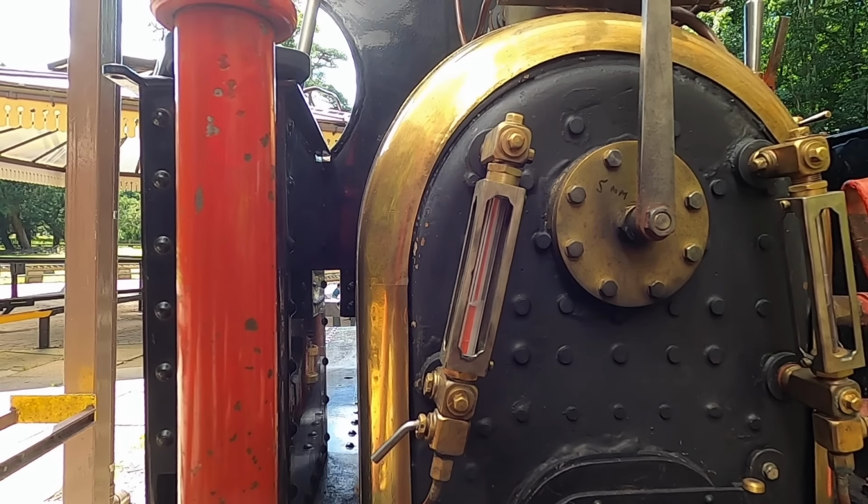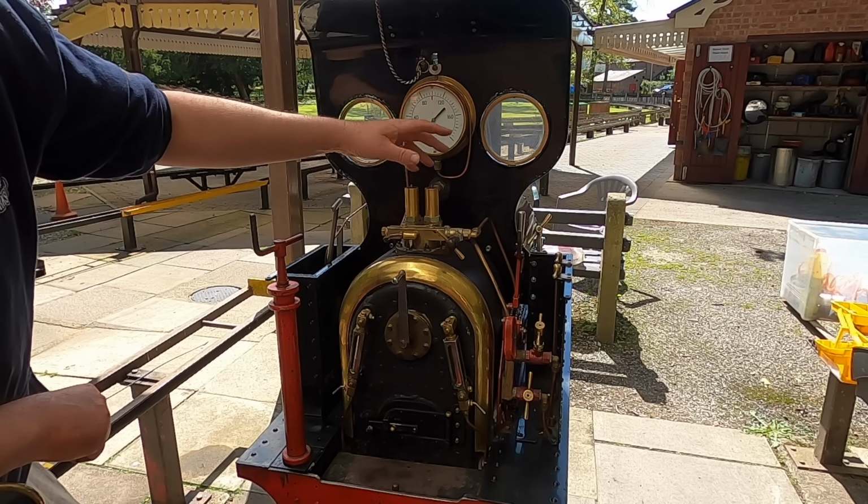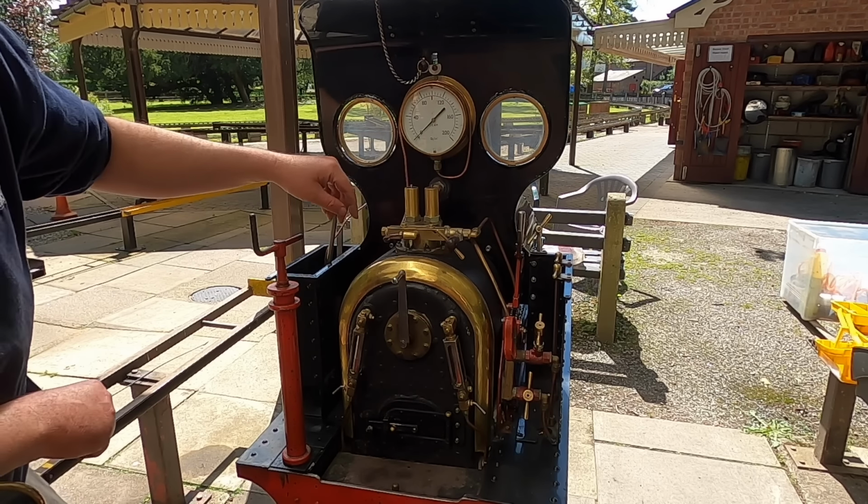So we'll just run through everything here on the back head. Obviously we'll start from the top. We've got the whistle valve here, the rather small pressure gauge, the two safety valves are here, which is quite exciting when they go off in your face. The blower is here, our regulator, our two gauge glasses, our two gauge glasses blowdown valves are here and here. The reverser,